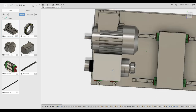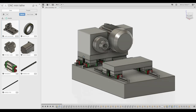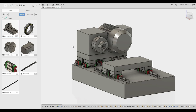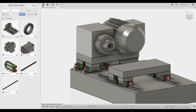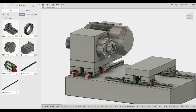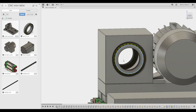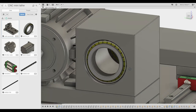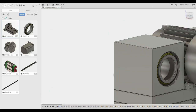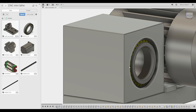The whole point of designing a machine this way is that anything can be replaced. In terms of cost, the spindle assembly is probably going to cost no more than about £200, including material and bearings — not including machining time because I'm the one who has to make it and I don't pay myself anything. The next most important thing is the spindle bearings. At the minute in this design we are using tapered roller bearings — nice, big, beefy tapered roller bearings. They're about £30 a piece, which isn't horrendous, and they should be totally fine.